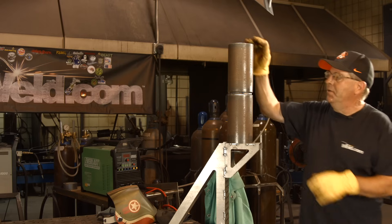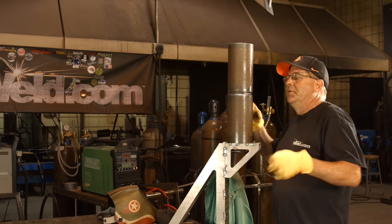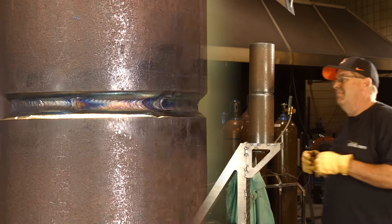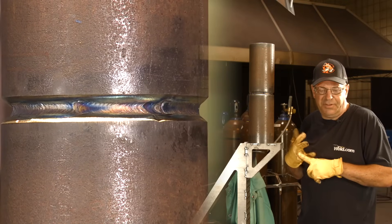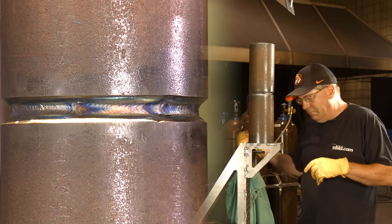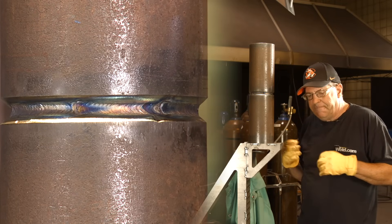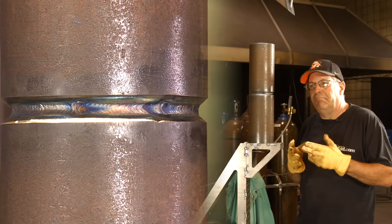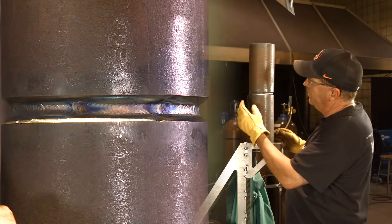Okay, recap here. We had set this up — 4-inch Schedule 40. The viewer and customer was concerned about running roots. He was blowing out the top side; I think he was running too hot. I didn't have any help over here on camera. I'm thinking I was running about 90 amps, maybe. I had a 1/16th root face, so that's kind of mild, and I had the 1/8-inch wire on the backside. Ran a little bit over here for a test.